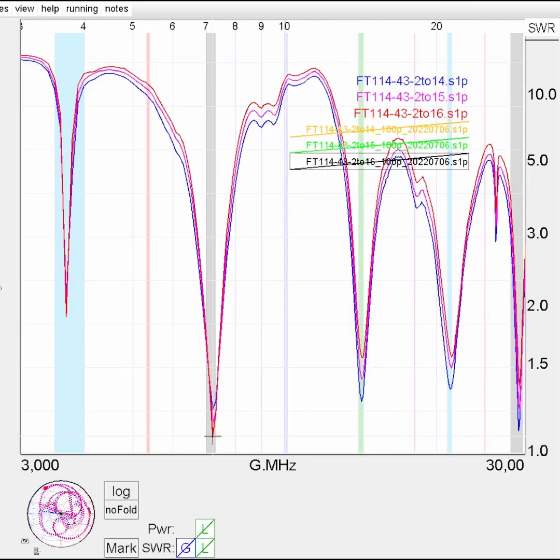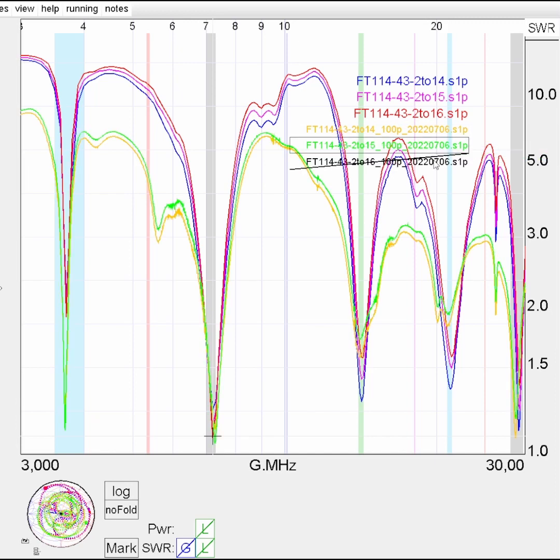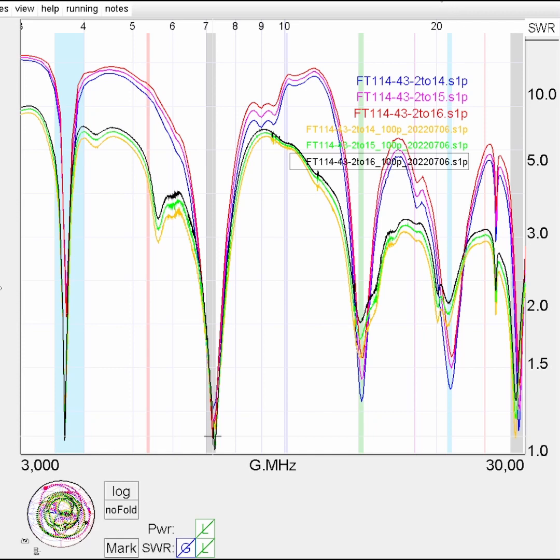In comparison to that, I have three plots recorded a few days ago. This is how my antenna is mounted at the moment — it is not sloping as badly as before. I used a spider pole to get the other end of the antenna a bit higher into the tree. This is the difference that just changing the mounting position made — nothing else was changed, still the same antenna, still the same transformer. Let me zoom in so that we can look at the detailed plots.